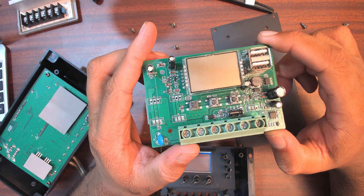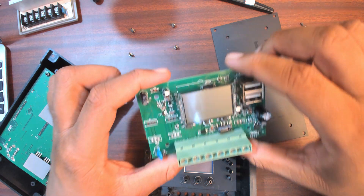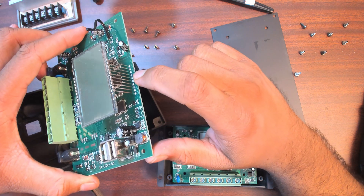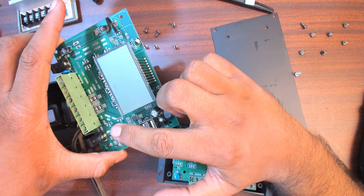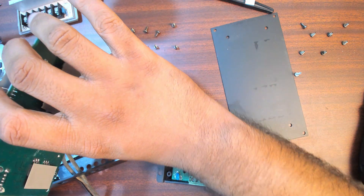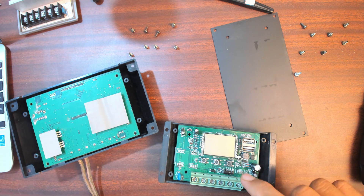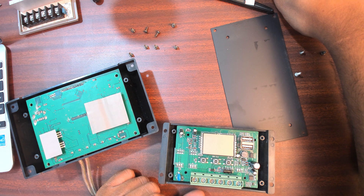With only op amps and no real microcontroller, this doesn't appear to be truly programmable - so what's controlling the display is probably all handled by one chip. For comparison, the real MPPT has an LCD controller plus a separate microcontroller that probably handles the actual MPPT function, plus external shunt resistors, a thermal probe, and extra MOSFETs. So depending on what MPPT controller you're buying - don't buy the cheap stuff or you're not getting any real MPPT at all, and that's what ends up not working out for a lot of people.